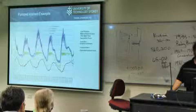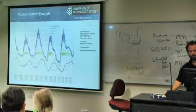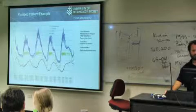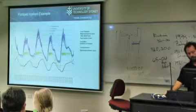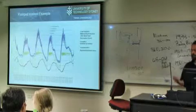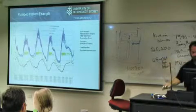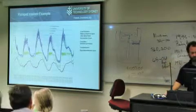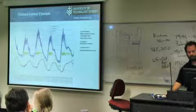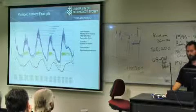This is data for 4 or 5 nights. You'll see the ambient temperature is the purple one here — we're peaking up around 22 degrees, getting down to about 13 degrees. The red one is the cold water we're storing in the tank just by doing night-time radiation. This has a convection cover over the top, and you're getting water down to about 8 degrees when the night-time ambient was up at 12 and a half.